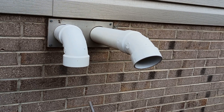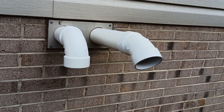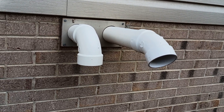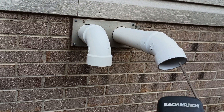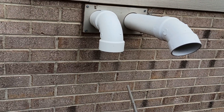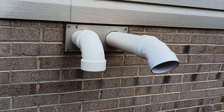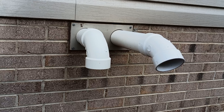Back when I first started, most of us were led to believe the blower might siphon out carbon monoxide and blow it in the house. But you're usually not going to see that. If you've got a hairline crack, that's probably not going to happen because the inducer motor will keep the byproduct pulled out through this pipe and overcome the blower pressure. For it to start putting carbon monoxide in the house, you've got to have a good-size breach in the heat exchanger.